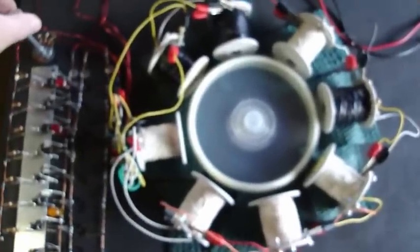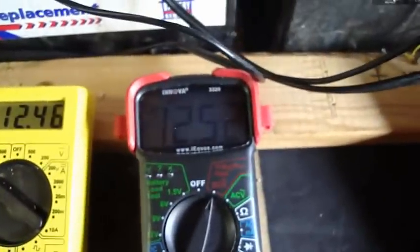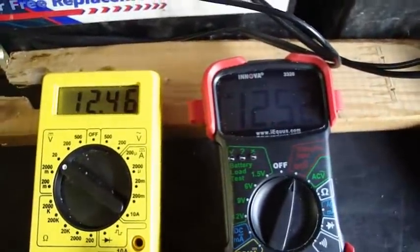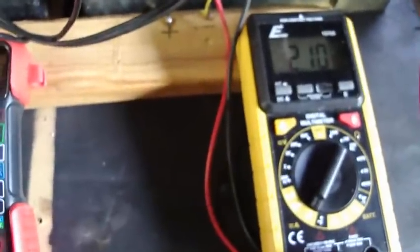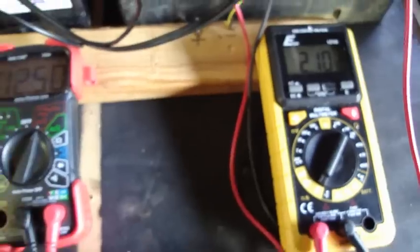The speed is a little greater than it was a while ago, but we'll just have to see what happens to the charging on this thing. I will put it all in the description. There — I turned the resistance of the pot all the way off and it slows way, way down. The voltage jumps up on the charge side and drops a little bit on the run side. It's down to 12.53 now, 12.52 on the run side, and it's up to 12.46 on the charge side. We're now drawing 2.1 amps.